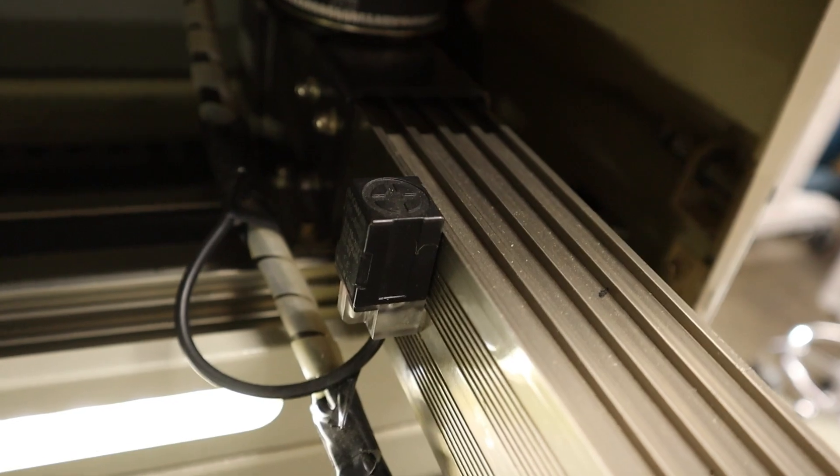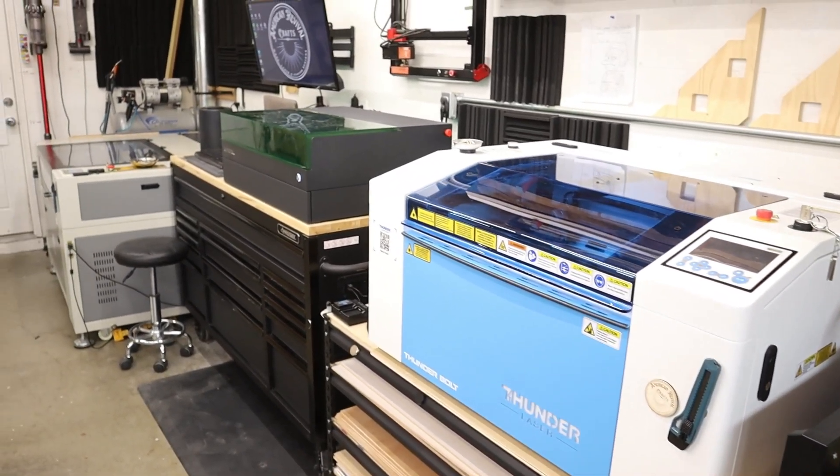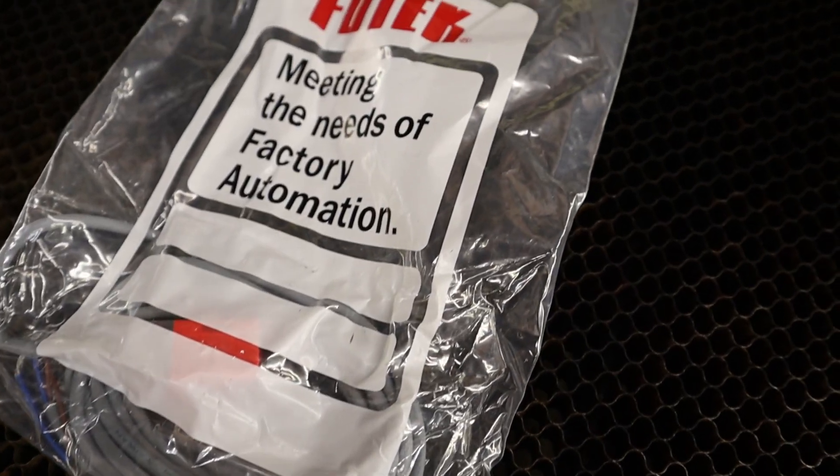During the time that I've owned this laser, I've only had a couple of parts go out and they've all been easy fixes. The first thing that happened is one of my proximity sensors went out. The second thing was my autofocus probe wire somehow got nicked and shorted out — to solve that problem I just removed my autofocus probe. For a while this was the only laser I was using, so it was extremely important that it was constantly up. One thing I did to make sure I was always running is I made sure to buy some spare parts: a spare laser tube, spare proximity sensors, and a spare power supply on hand, just in case. Because if something does happen to those items, it's going to be at least a week to get them delivered — it's not stuff you can just run out to the store and get.